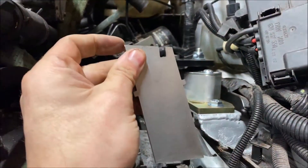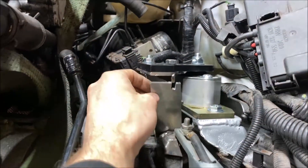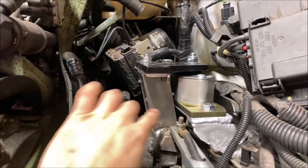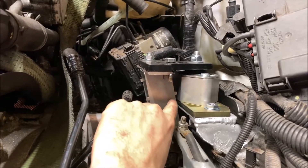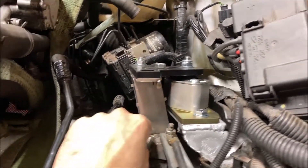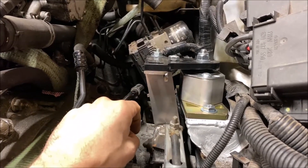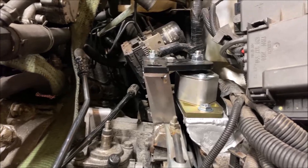Out of just some flat bar - I've done a bit up the back, roughly tacked it, and then there's going to be two side bits which I'm going to tack in situ. Then we're going to take it out, weld it all up, and then possibly just clearance this bit a little bit. There is a gap down the side but it's just nice to give it a bit of extra gap. So yeah, once it's all tacked up, take it out, weld it, and then this mount is done.